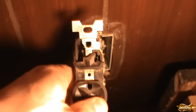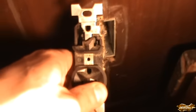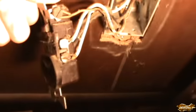Thankfully this is in the newer part of the house, so the wiring is not quite as dodgy in this part of the house. I am actually very glad this happened. What I'm about to show you might also be the cause. Look at that there on the neutral — it's got a little hot right there. And you can kind of see some char in there on the inside of the box. One thing I don't like about these metal boxes — this addition was built in about 1974, so this was the norm for that time period.